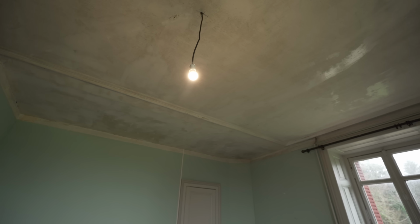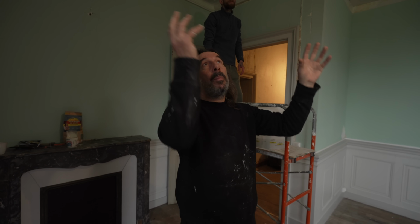We can put a coat of paint on, and then any discrepancies in the ceiling will show up a lot more, rather than trying to see them all patchy like this. When people paint over distemper, the best thing you can do is just try and do your best. There's nothing else you can do. You can't scrape off the paint; it won't come off. Even if you add moisture, it still probably won't come off, because the paint itself probably has some sort of moisture barrier.